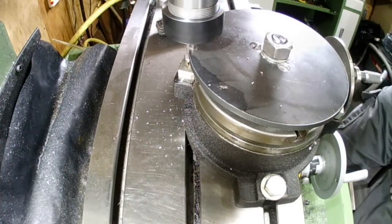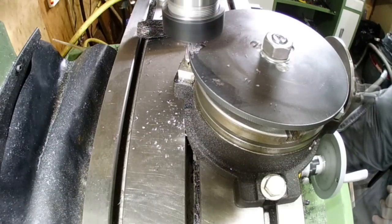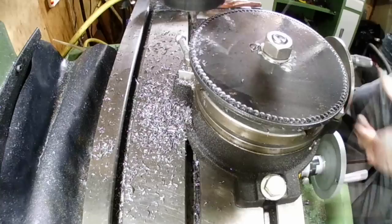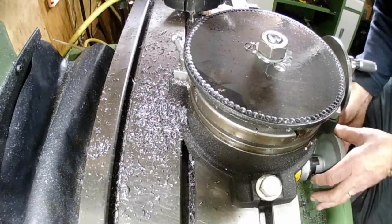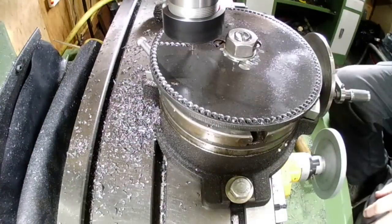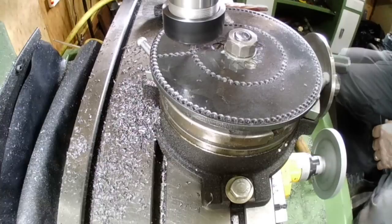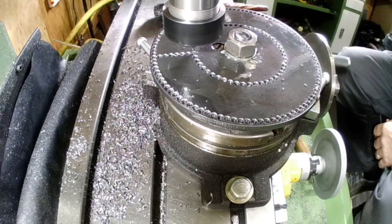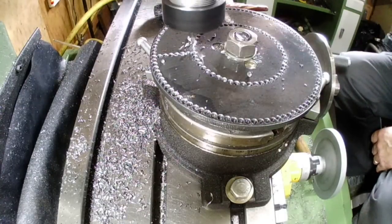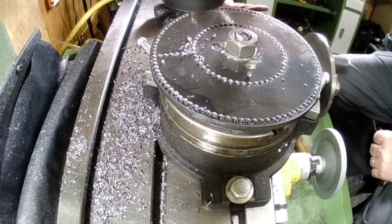All the holes I've cut so far are to give me the full range of holes for cutting the holes in the gear index plates. So here we are cutting the first set of 100 holes using the 90:1 indexing table. I'm not going to do the full 3,500 holes in one go. I'm only cutting the 100 and the 51 set separated by 6 separate lanes representing 6 more sets of holes.